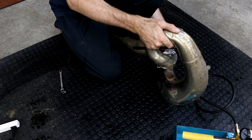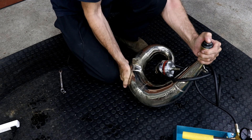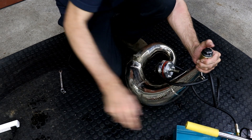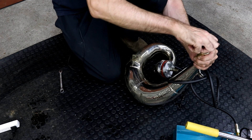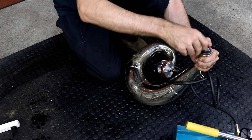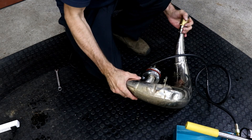That's a super important part. If you have a lot of air in it, it can act explosively so it can be very dangerous. You want to make sure you've bled all the air out — do it at least two times, bleed it until you don't get any more air and it remains full, then you're sure it's fully bled.